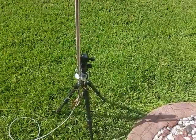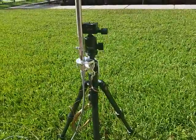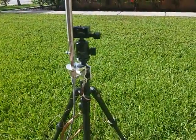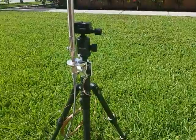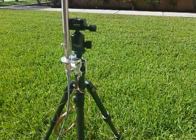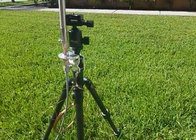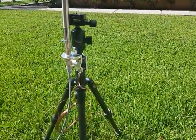It's a nice vertical antenna that can extend up to 17 feet. At about 16 and a half feet, you get a quarter-wave vertical on 20 meters, and accordingly you can collapse it to get coverage of any of the higher frequency bands.